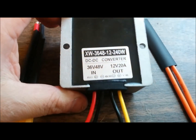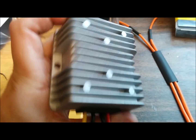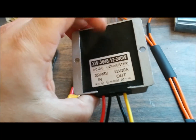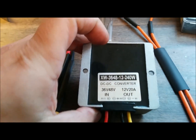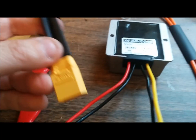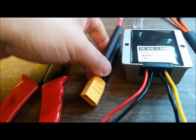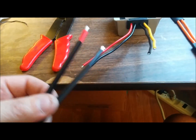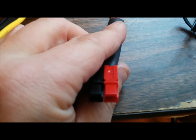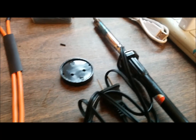What I'm going to be doing is converting them to a 12-volt system — stepping the voltage down. I'm using a step-down converter I got on eBay; it has a very large heat sink, it's waterproof, and it can take up to 48 volts. I'm going to solder an XT90 connector on the input side, since that's what my battery uses, and an Anderson connector on the output side for running my 12-volt applications.